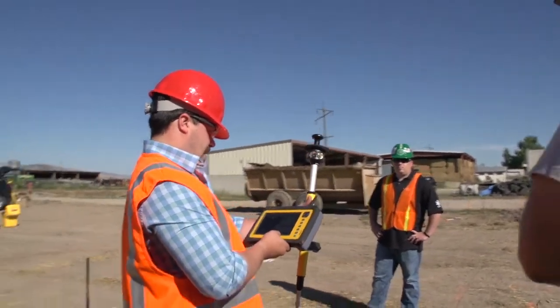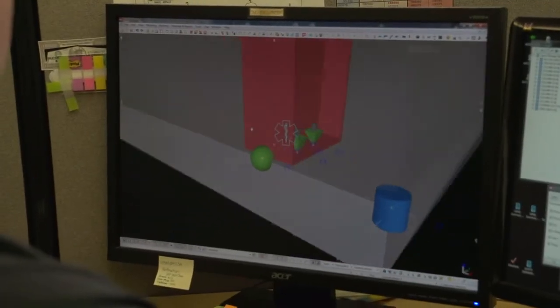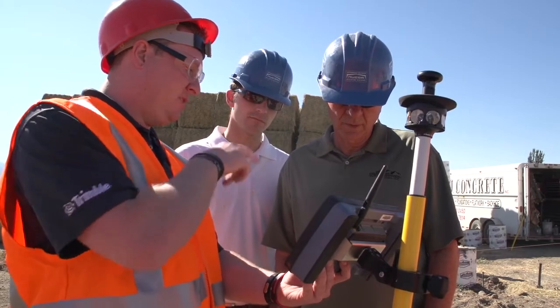Can I get the files from the contractor, or do I have to download them myself? Nucor will actually be able to provide the same level of detail project files that they did today. Inside their Tekla software, they'll be able to export to you centers of columns, footings, and anchor bolt layout. There is a learning curve, and to help work past that, that's why we've partnered with Trimble and the guys at Building Point — because they provide training for the equipment being sold.